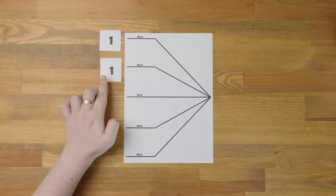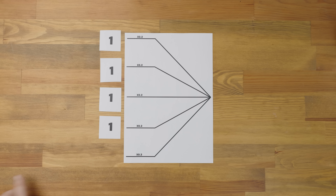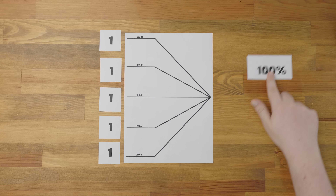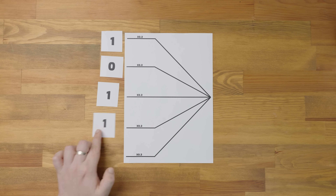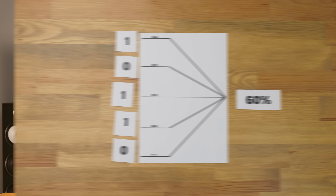So this seems to be a moving average FIR filter approach. What this basically means is, for converting DSD, instead of having a single element that switches on and off at the DSD rate, you instead have a number of equally weighted elements, and the converter itself actually averages the past few samples out. So if you had, let's say, a five-element approach, you stream data in until five samples have been loaded, with each output valued at 20% of maximum output. If all the samples were 1, the average value that gets output is 100%; if all of them were 0, it's 0%; and if three of them were 1 and two were 0, the average is 60%. The advantage of doing it this way is you are mathematically filtering out a lot of the potential switching noise.